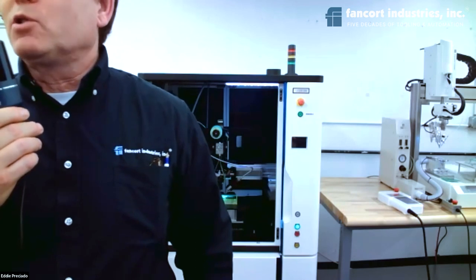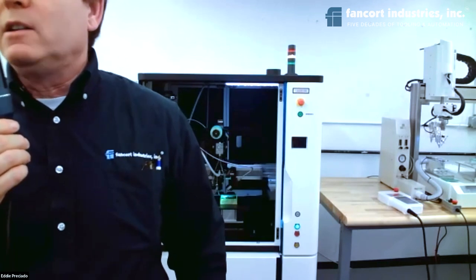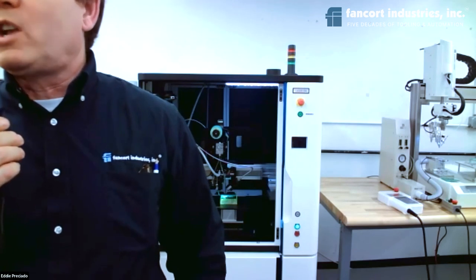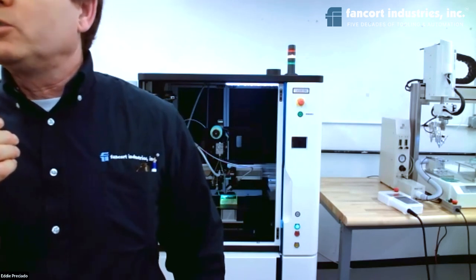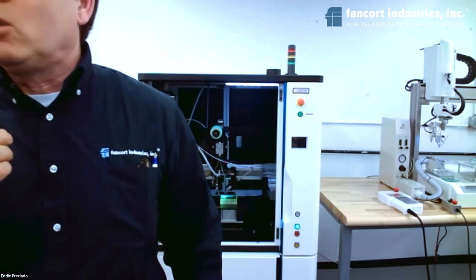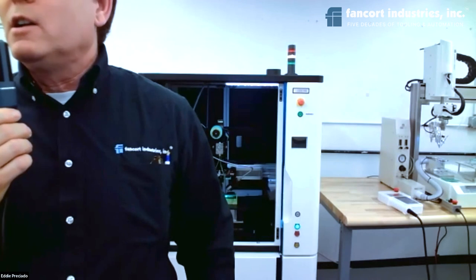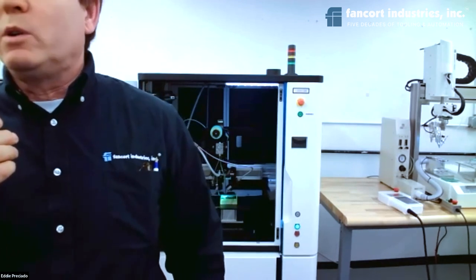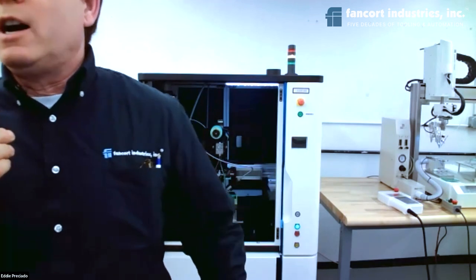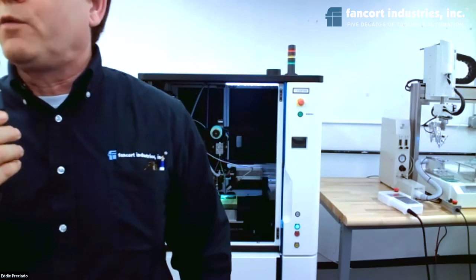As far as the power per square millimeter, we would probably be using a 45 watt laser to do that. It all depends on what setting we would use in order to make the solder reflow properly for that area, and also without affecting other parts of the board or what may be around there. But with a large field like that, we would definitely need to take multiple shots at it to do several areas before we could solder that whole field.